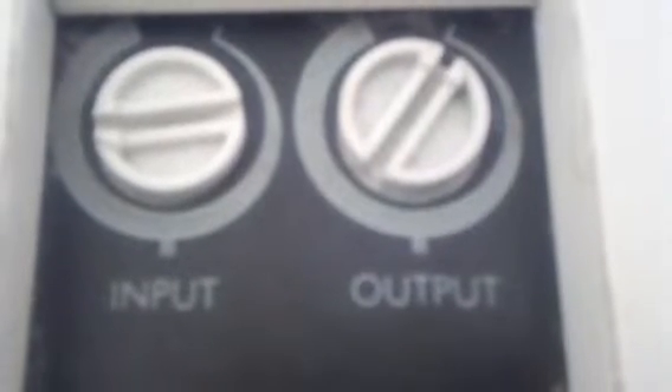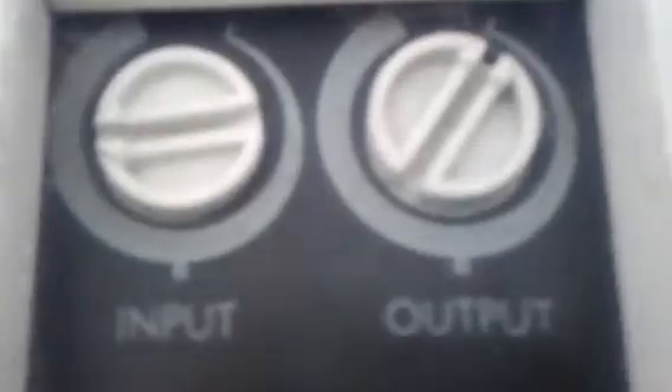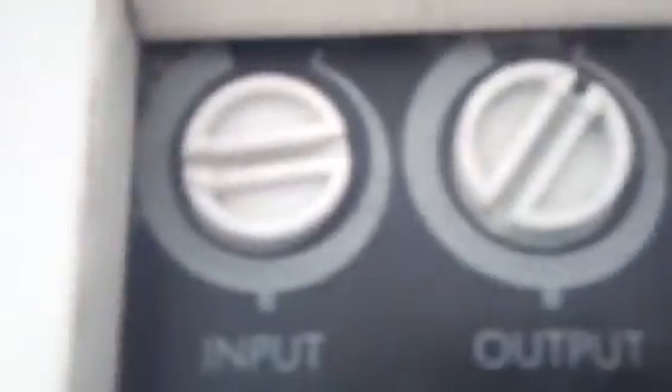There's actually a metal cover inside the storage heater that lets the heat out. You can see this when you adjust them. I normally adjust them with a penny piece, but just be careful because the dials get very brittle and can break easily, so just do it gradually to free them off.